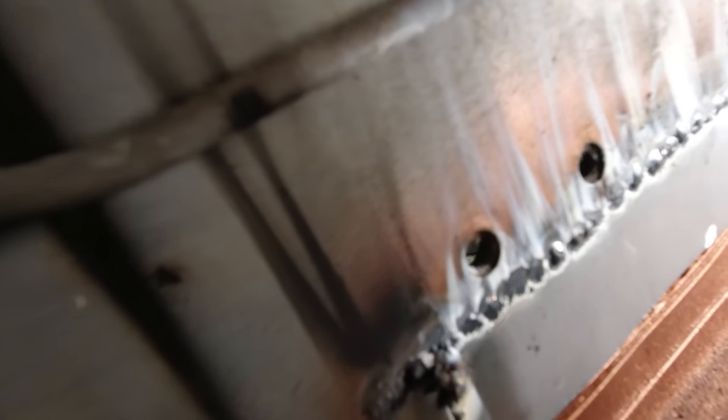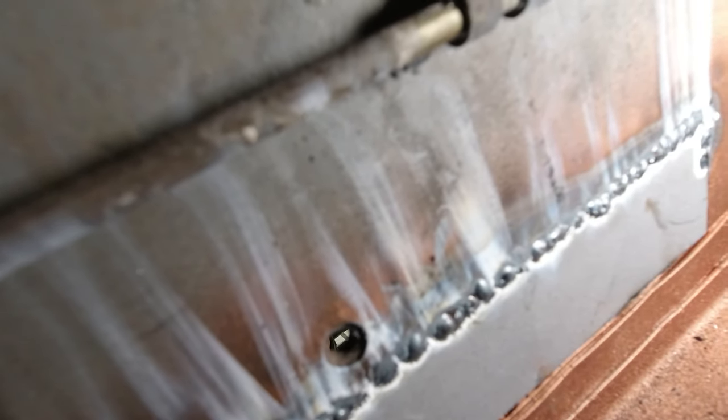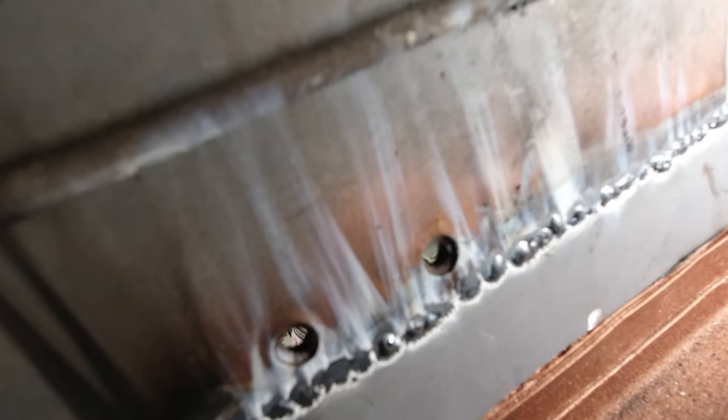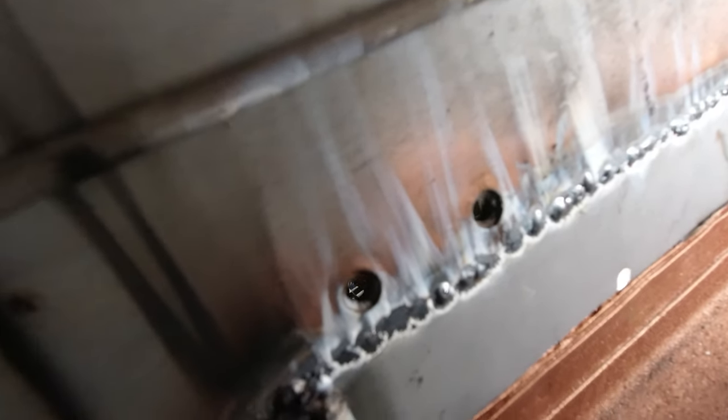I did weld it in pretty much in a line, which normally you wouldn't do because you'd run the risk of warping the panel by putting too much heat into it, but this is only on the strut tower so I didn't really need to stitch it. Some of the other areas that are a bit more prominent I'll be a bit more careful. Let's have a look at what it looks like inside the engine bay — you can see the back side of the weld here and the penetration all the way along. It's pretty reasonable, certainly enough for a non-structural part. I'm going to run the MIG over the bottom half of that to get it all tied in from this side.